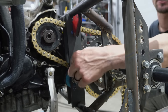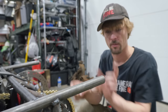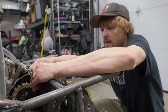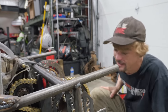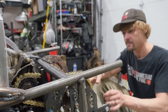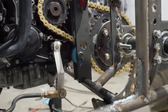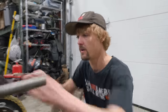It's slotted for adjustment and I drilled holes so we can remove this motor mount bolt. I just need to tack it in, put some tension on it and tack it up top now that we're done plumbing the fuel stuff. We've aired the shop out and we've got our fire extinguisher just in case. I'm going to give this thing a tack, cut the chain, and put the master link in. Hopefully we can roll this drivetrain over and see how it looks. This is looking pretty good — definitely one step closer to seeing this thing rolling under its own power.